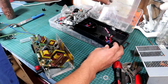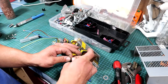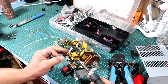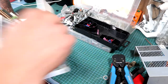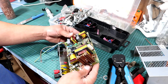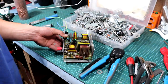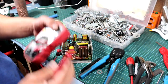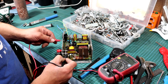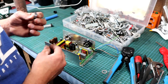Now it's just a matter of putting the board back and doing all the wiring. Starting with the output wire, using spade connectors - one for negative and one for positive. Sliding them onto the wires, crimping them, and adding a bit of solder to make sure they stay in place. Before dropping the board in, adding a small amount of thermal paste for the two MOSFETs. Both the negative and positive connectors are attached to the binding posts. Importantly, the two output connectors must be isolated from the case - both negative and positive are confirmed isolated.